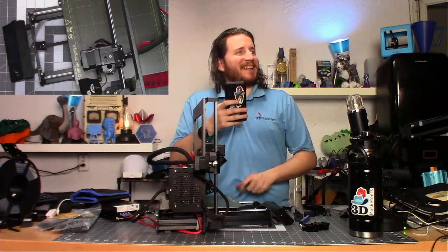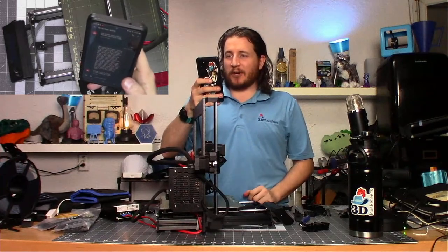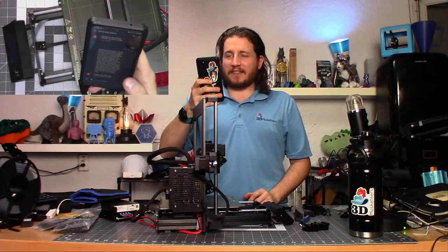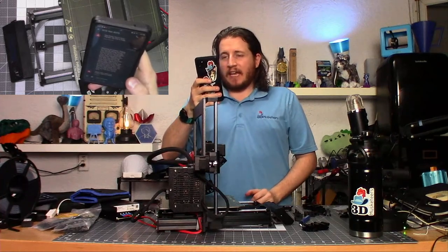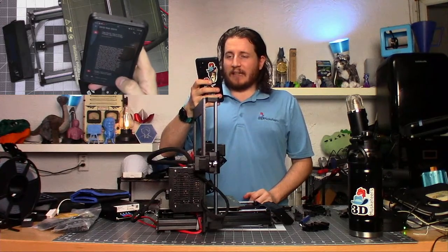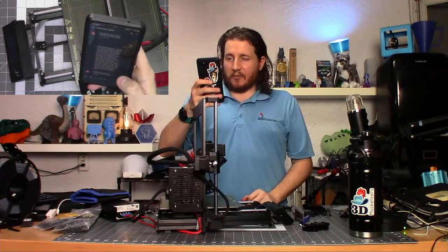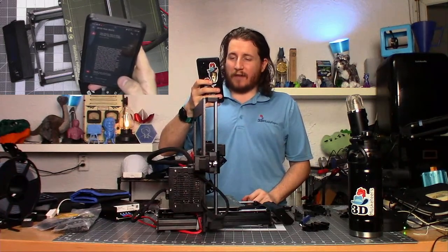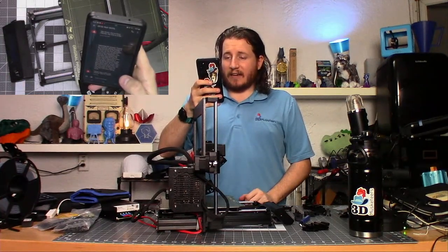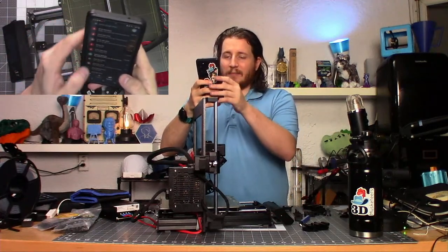Oh, the client is watching the stream. He's texting me. He says, watching the stream. Thanks so much for going through it. The condition of the printer is much worse than possible. You can let your audience know what happened. I was printing ASA, realized the first layer was peeling off, and I overrode the automatic outlet that's relayed by the temp probe. Left it there with a handheld ceramic heater running for over an hour. Then I got a print failure. Heater was located inches away from the left side of the printer when looking at it, dead on the LCD menu facing front. It was a 500 watt ceramic element heater.